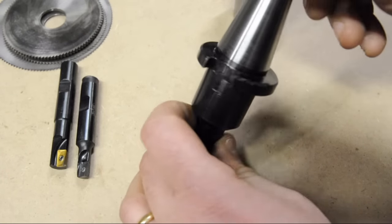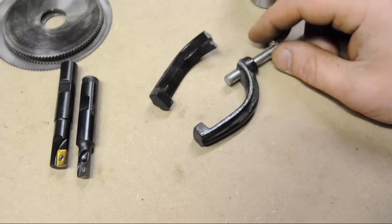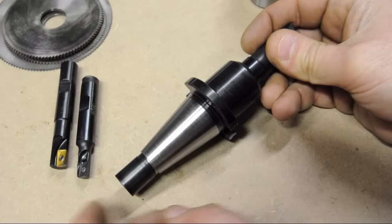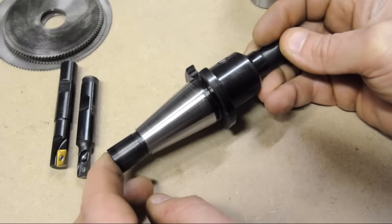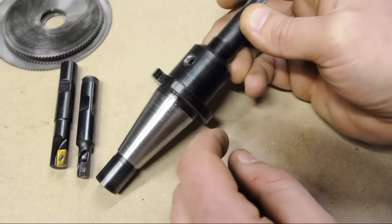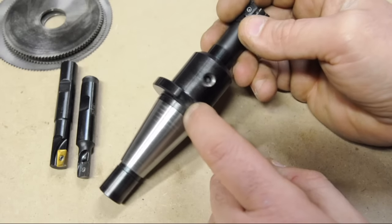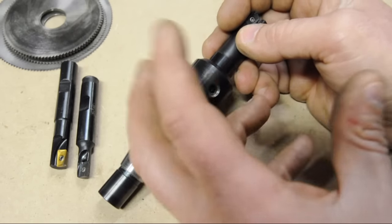Here's the one I already made for the three-quarter inch end mill — turned out pretty all right. It seats well in the taper, though it did get chattered up a bit. A v-block clamp broke on me while I was cutting the dog and it spun, and luckily didn't do too much damage. I do like to blue my tooling when I can — it looks more professional, but I do it mostly for rust prevention and corrosion resistance. I've got tooling from quite a few years ago both with and without blue, and the ones that are blued still look like new.